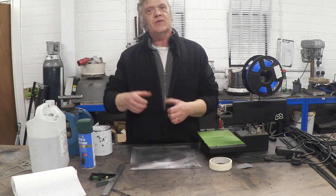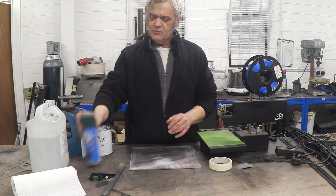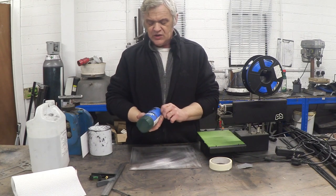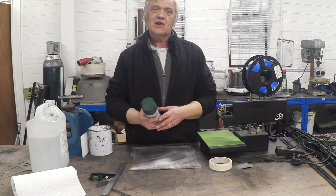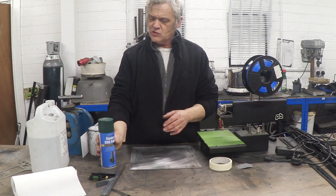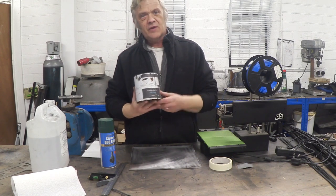The process is identical whether you make it on rubber, on thicker aluminium, or on a different aluminium grade — it's the same method. To do this we're going to use a method I explored in earlier videos, where we take the bare metal and coat it with a heat-resistive insulating paint. This is stove enamel, good up to 650 degrees centigrade.